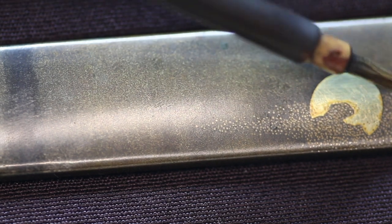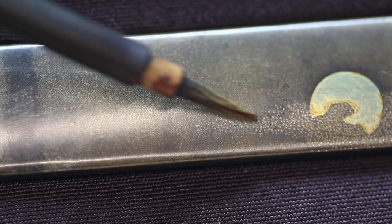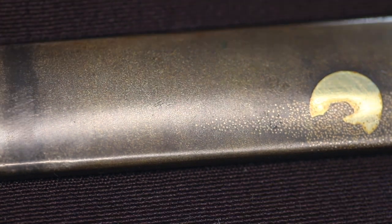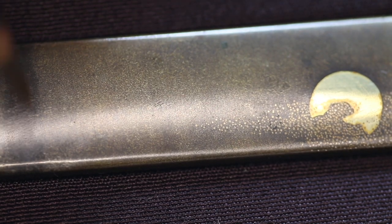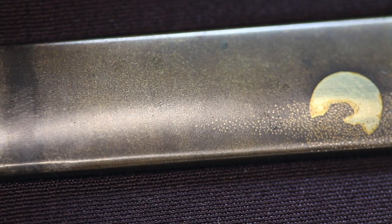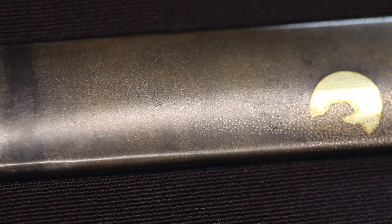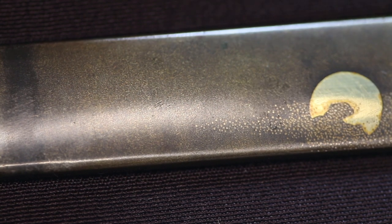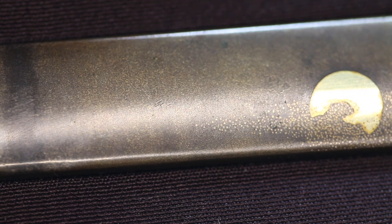The dark staining around the moon is quite lovely, and the darkening around the gold haze also looks quite lovely. However, this kind of staining is far less attractive in these bands here. What these are is the result of a previous box that had little elasticated placeholders across it, covered in crepe silk, but the rubber band inside caused this — because the vulcanisation of rubber involves sulphur. Traces of sulphur remain, impregnating the fabric and subsequently the surface of the metal. So this black staining is a problem — not terribly uncommon, sadly — but fortunately I know how to repair it.